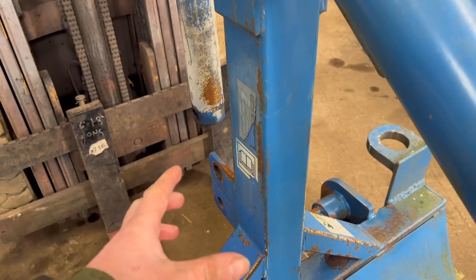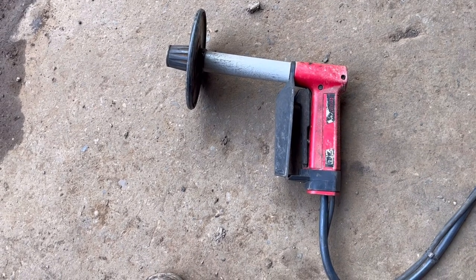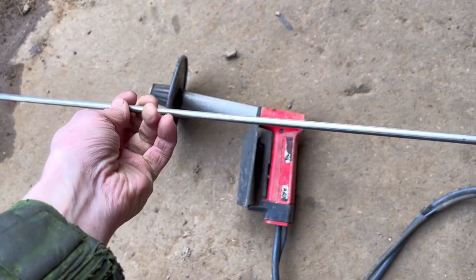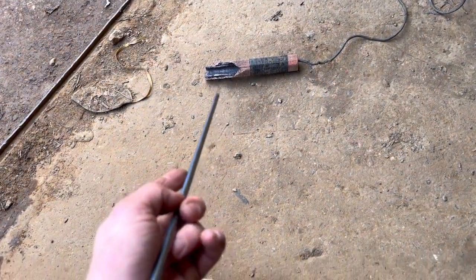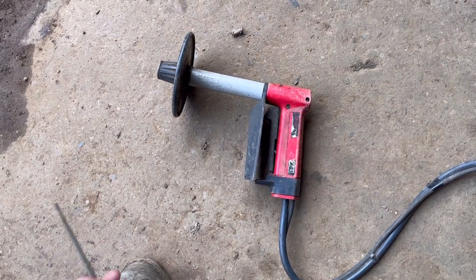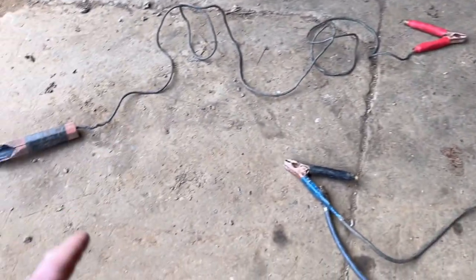I thought you might be interested in seeing the thermal lance, so I'm going to video that. This is the hand piece — it's an Okay Slice thermal lance — and there are your rods. I think they're quarter rods. You put that in the hand piece, then you strike it on the striker, it direct short-circuits it, and then it blasts oxygen down the inside of the rod. It burns the rod away, and then whatever you touch the rod against it melts. You just connect one end to your battery and strike onto the other side of the battery.